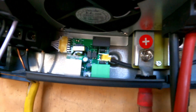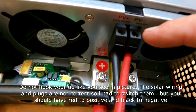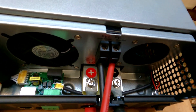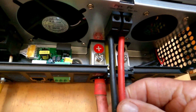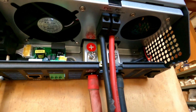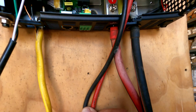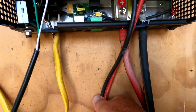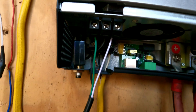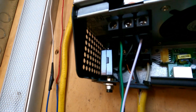The two terminals in the very front are your power coming in from the solar panels. Right now I only have one solar panel hooked up — it's a 325-watt solar panel — and that's been the case for the 32 days of testing. Note that the solar wires appear backwards because I got them wired differently down at the panel, so make sure you read your instructions. Also, once permanently mounted, make sure you have something to secure the cables properly.